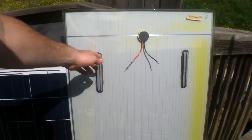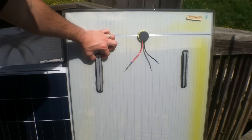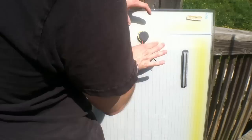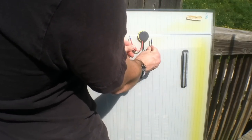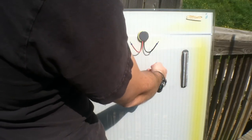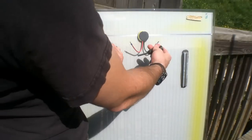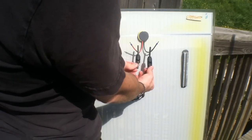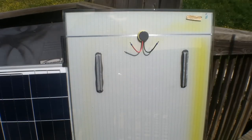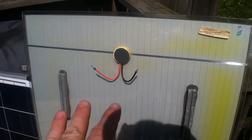Some of these panels already have racking channel mounted onto them, so you could actually do the bolt-through, slide-through, or the channel slide with lock down — there's some versatility there. You can also take updated junction boxes and add them to these type panels. You can run the hot lead and the ground lead in to the bus bar, then come off the bus bar with your hot MC4 and your ground. Those would go into the lead and drop out as a standard modernized MC4.